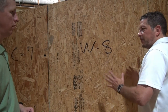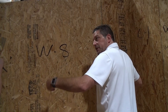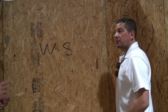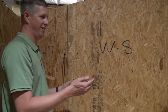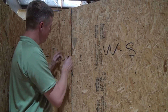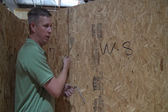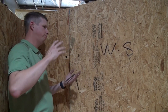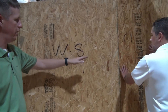What about the inevitable things that happen in the field? Say a wall like this is running between two spans — we have a foundation, a deck, we snap the lines. What happens if these panels grow slightly as we get over to the corner? That's a very good question, because we would prefer them grow a little bit rather than not be long enough. You can always cut a board, but you can't stretch it. It's pretty typical for there to be at least a sixteenth of an inch between every connection, and if you've got a fifty-foot wall, that starts to add up.